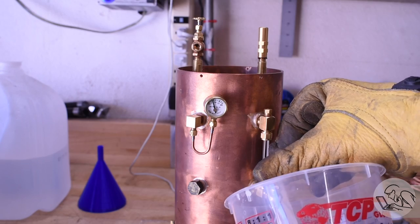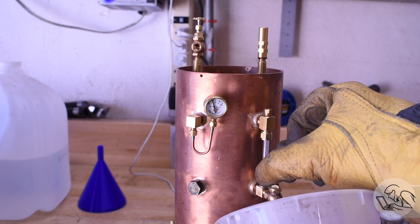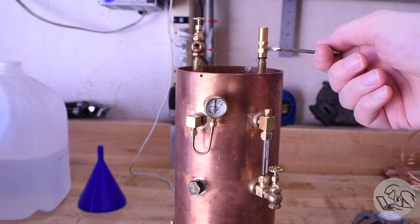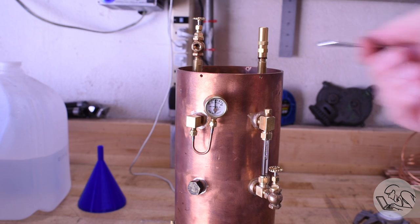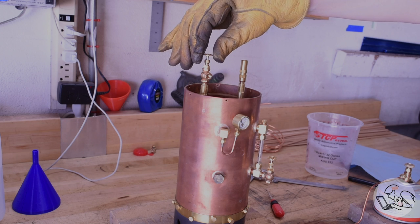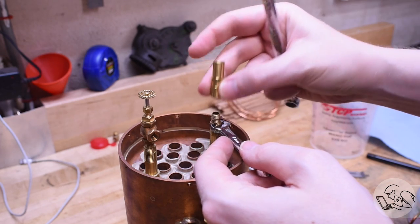With a little persuasion it did finally close again, somewhere around 25 psi — not great performance. And it's not evacuating steam fast enough anyway. While I'm here, I'll test the blowdown valve on the water gauge. There's an air bubble in it, so I crack that open and blow it down, close it again, and we've got a clean water level again — a little victory. Then I lit the burner again and gave the safety valve one more try. Once we're back up to about 50 psi it opens again and starts blowing off, but it's not really staying ahead of the burner — maybe barely equalizing with it. Ultimately, I don't think this valve is going to work for me as is, so I bled the pressure out and let it cool off.